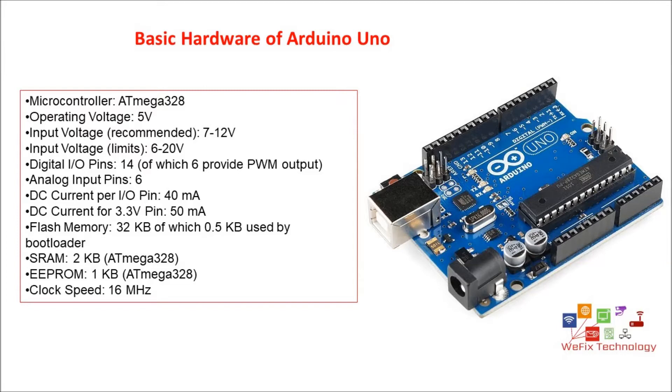The DC current that is maximum permissible for any input/output pin is 40 milliampere, so we can run an LED with this current — a standard 5mm LED draws about 20 to 25 milliampere. The DC current available for the 3.3 volt pin is 50 milliampere, so we can connect a tiny microcontroller-based module there, such as a Wi-Fi shield or similar 3.3 volt modules.